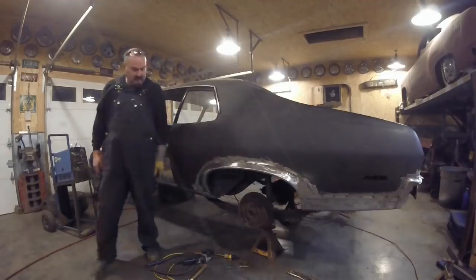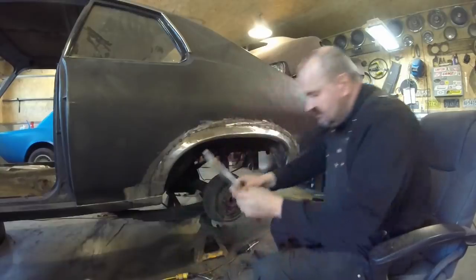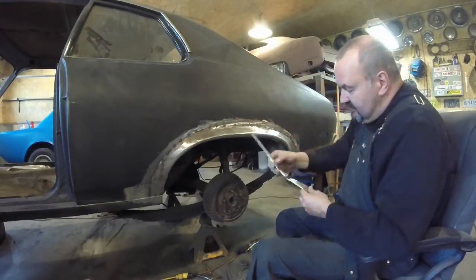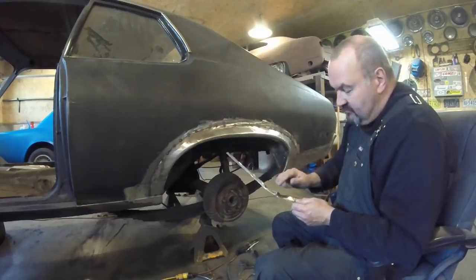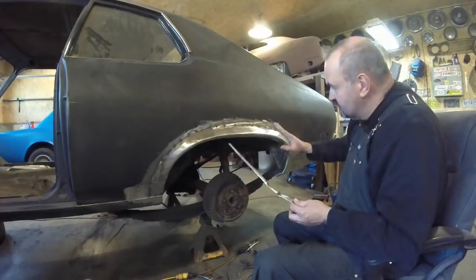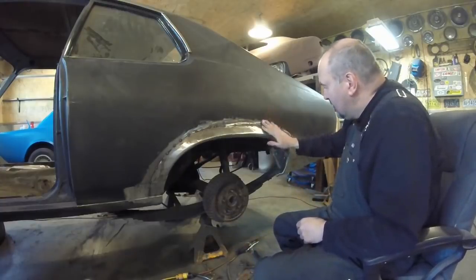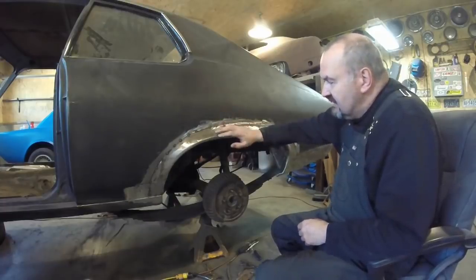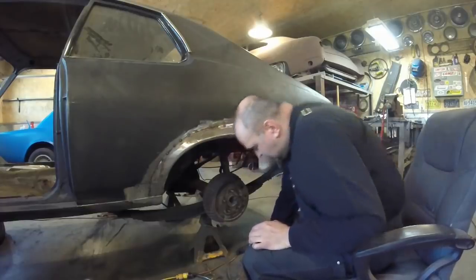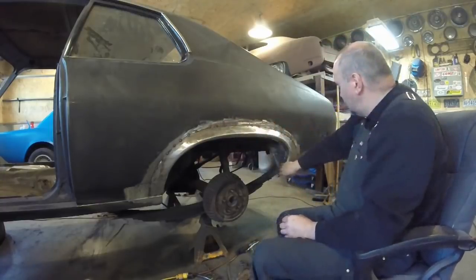There's that section of the quarter panel. I'm going to line it down to the rest of it and get it all fitting in there. I got it on there and got the pieces out from this side — the two sections of it. This was trouble. I ended up having to recut all my welds along here to break this off. Every now and again you'll come across a spot where you've actually welded really solidly. She welded solid and it wouldn't let go. I just re-welded it after I got it out. I made up this little piece of steel — just stick it in there, bend it off and pull it out if the top was in too far.